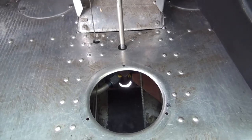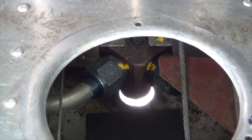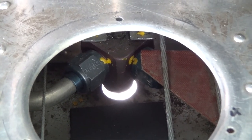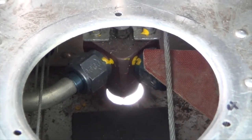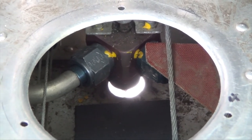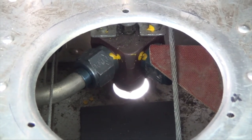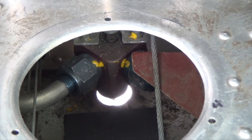Let me show you where that linkage is. This is the linkage that goes down lower, into here, and this is the actual fuel selector valve right in there. You can see the actual fuel line coming in on the left — there's also one on the right, a little buried underneath the cabling. We have to dig that out today with the certified mechanic and replace the O-rings and any other rubber that's gone bad over the years. It does leak — it doesn't completely turn off the fuel. But it does work: left and right tanks get gravity-fed out to the carburetor.